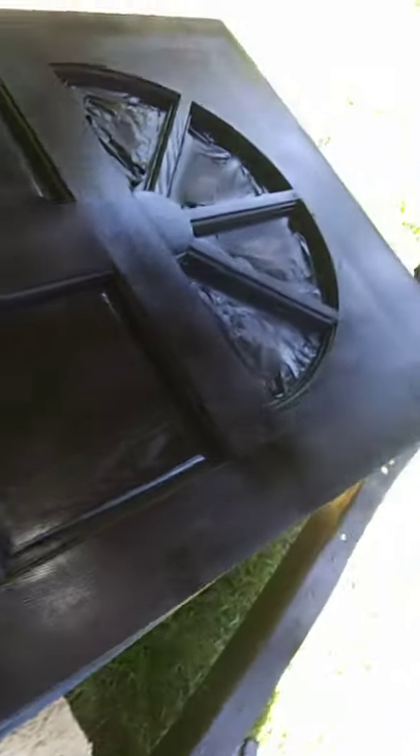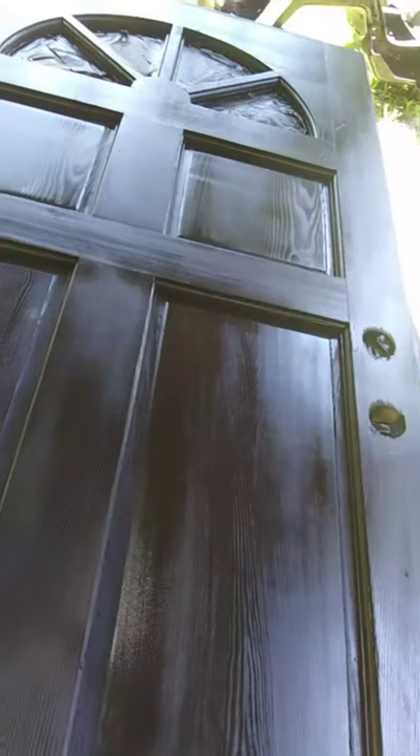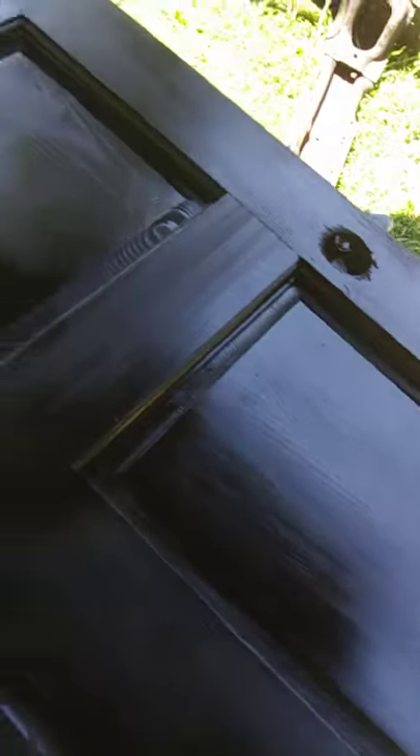The door is sprayed and actually looks pretty good. I'm going to let it cure up. On the back side I'm going to use a stain and polyurethane on the interior side. But for the exterior we just use the Rust-Oleum thinned down with a little acetone and put in a gravity feed paint sprayer — it's a Snap-on spray gun. It comes out really good and uses a lot less paint. All your little corners, everything, get covered real well. You don't have mist spots and things like you would with a brush or roller.